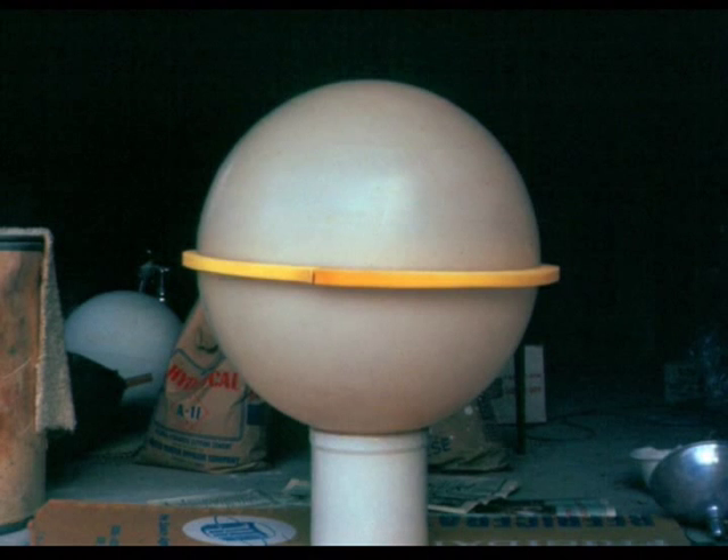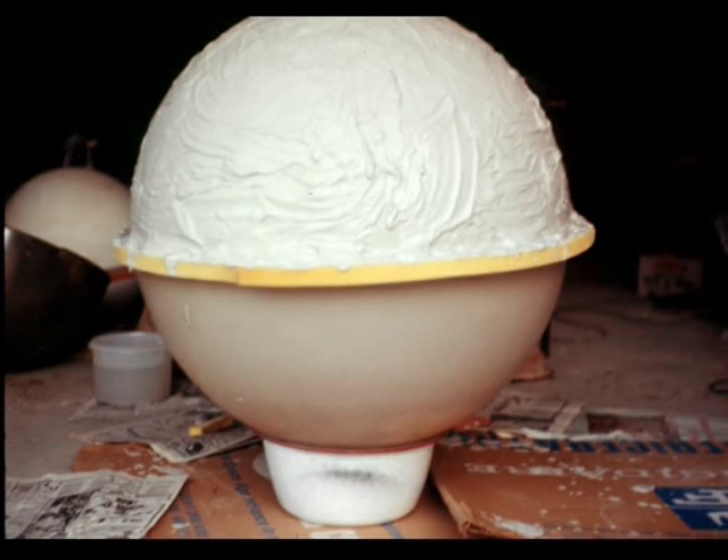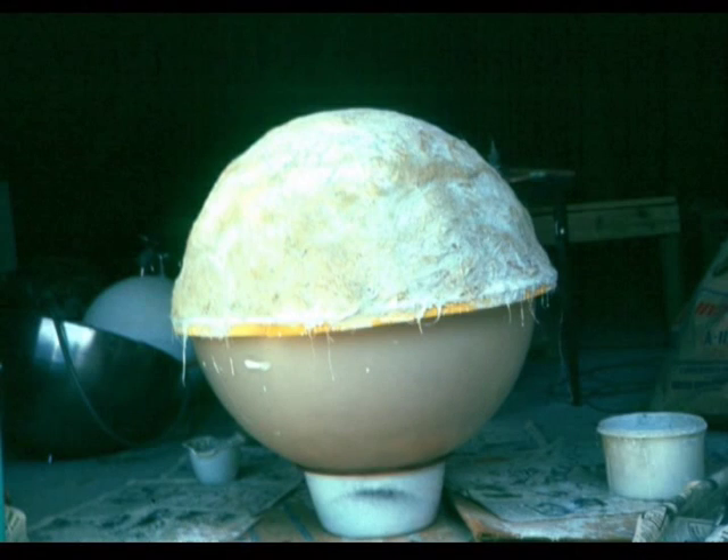Along the diameter is a sponge rubber that's glued on to the major diameter to set the flange. The top surface was waxed and then a plaster splash was made across the entire top surface and up to the flange. A manila hemp fiber impregnated with plaster was then smeared over the surface to give it some fiber strength so it could be handled.